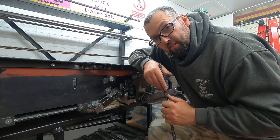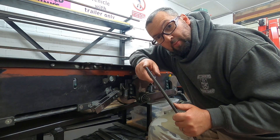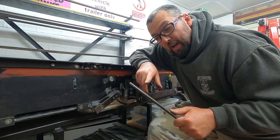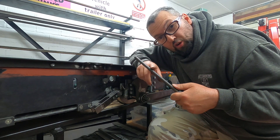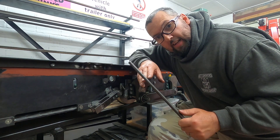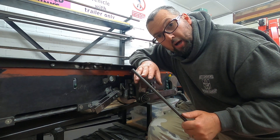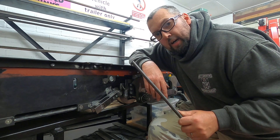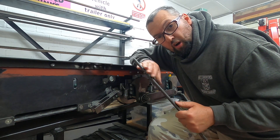It won't snap because we've done some tests. Welding this bar — if you wiggle it around, it snaps. The weld joint doesn't snap but the bar does, because it goes brittle once it gets to welding temperatures. A test with silver solder that my good friend did seems to be mighty strong, and obviously that doesn't change the properties of the rod.